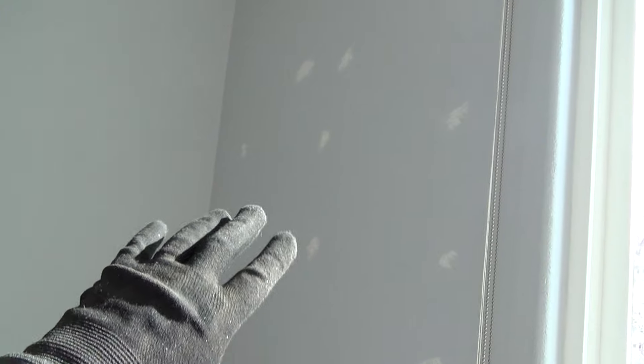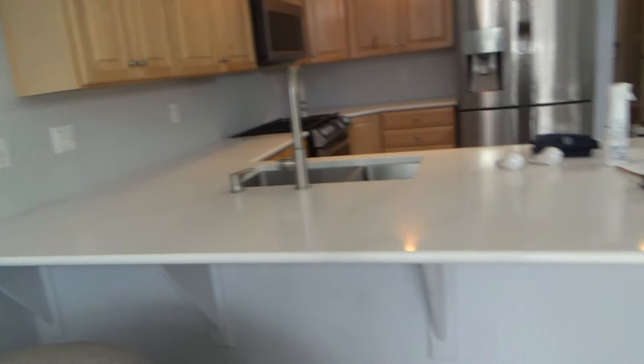The tenant started patching walls — I wish he wouldn't have done that. For all the little pinholes, I would have just taken a little bit of caulk. Instead he took some spackle over one little hole — see that? You could have filled that with just caulking. Anyway, I can see quite a few spots where I'm going to have to do some paint touch-up.